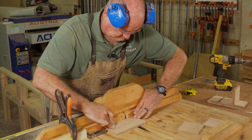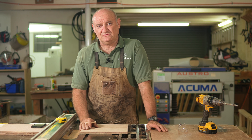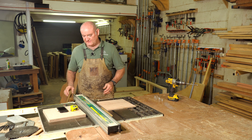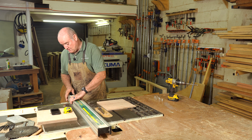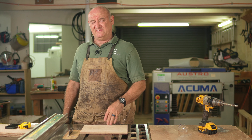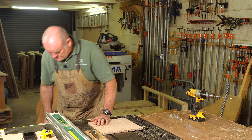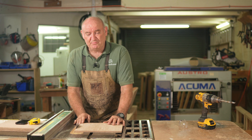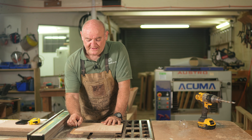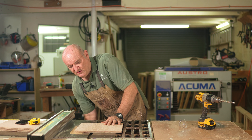A couple of things about cutting across the grain with plywood you need to know. Number one is that it's going to tear out if you don't do something to prevent that. Use a great sharp blade — that's the best advice. If your blade is dull or has too few teeth — a big ripping blade — that's not the right blade. You can get a new blade, or you can clean your old blade; it makes an amazing difference. Get a blade with more teeth — a cross-cut blade, or even a blade specific for cutting plywood. What matters is that you need a good blade with lots of teeth.